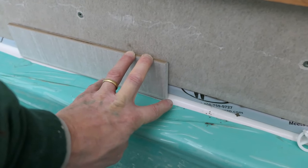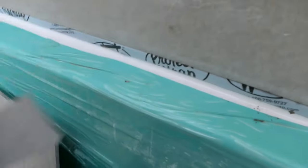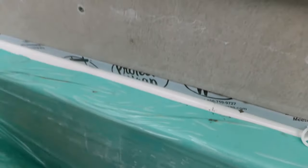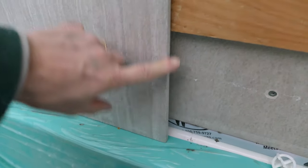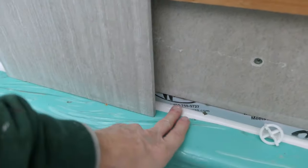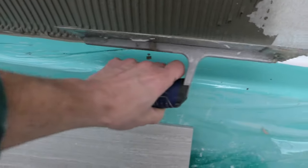So: if you're using a small tile, you really must bring the backer board down over the lip. If you can't do that, you shouldn't use a small tile. If you have a large tile — six inches or better — you're fine. There's so much area that's adhered to the backer board that this little section here won't matter.